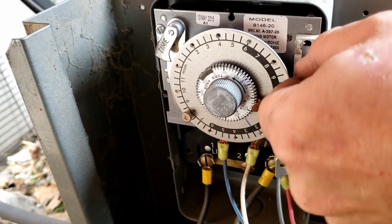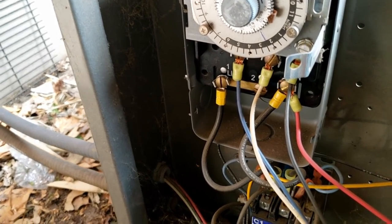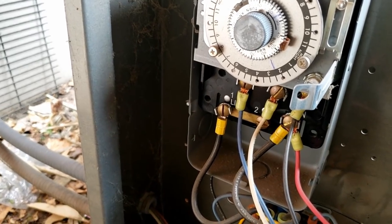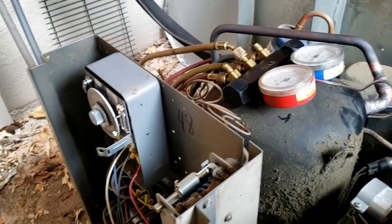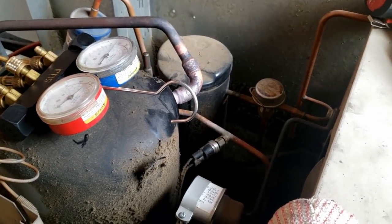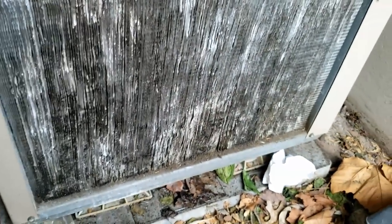They have an evaporator, a walk-in cooler before this, and that's going to get a lot of the humidity out prior to any of the issues they got going on, but probably going to switch it to that. And they got the timer set pretty high too. I don't know if the defrost termination is working properly either, but it sounds to me like it just basically accumulated, and between that and the refrigerant being low. So we've kind of gotten some progress going on here with this.